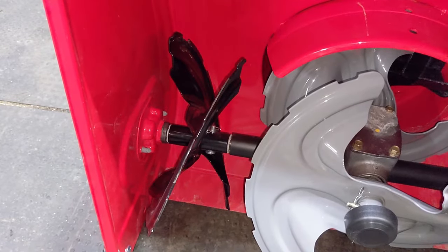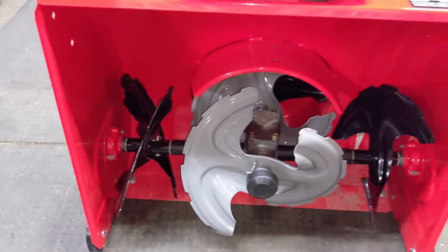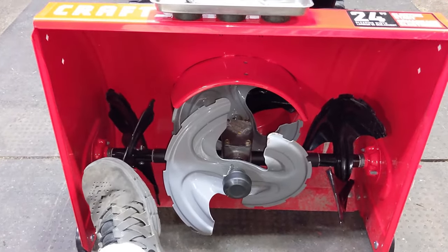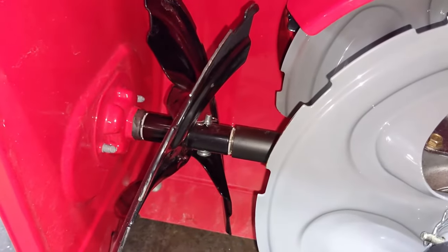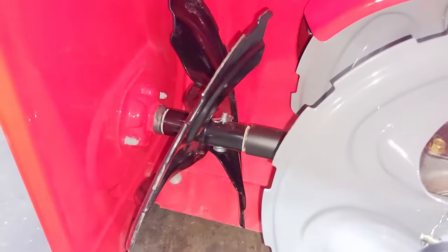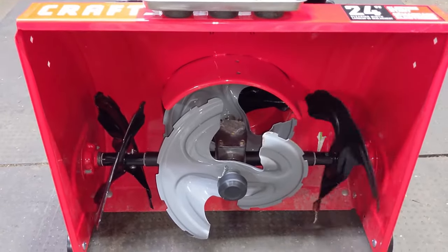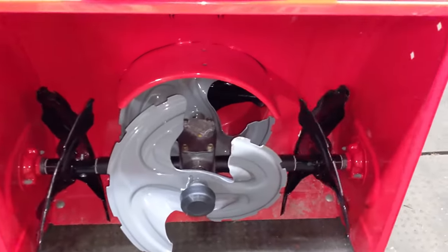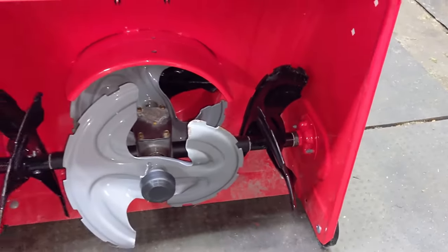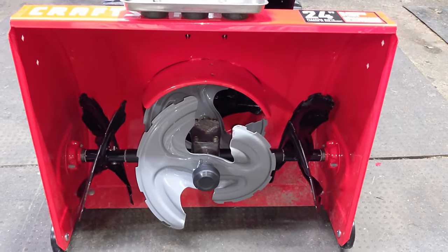For today's video, I'm going to show you what you can easily do to make sure your shear pins and shear bolts are still functioning properly. With the snowblower off, take your foot or a piece of wood and try to move the auger fin forwards and backwards. You can see it does not move very much, because the shear pin goes through the main shaft and prevents the auger fin from spinning. However, going over to the right side, you'll notice that one keeps spinning — that is because there is no shear pin installed on that side, as it most likely sheared away while my customer was using the machine last year, which is when he started running into issues with the snowblower not throwing snow.